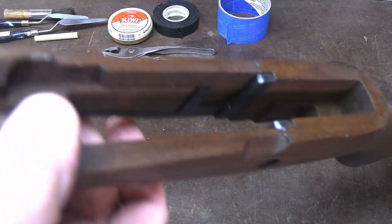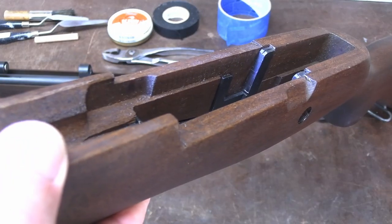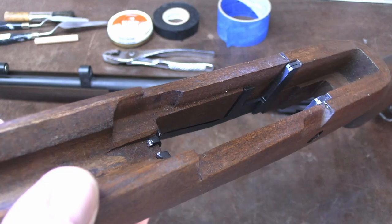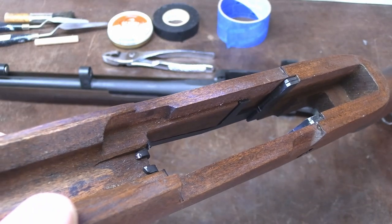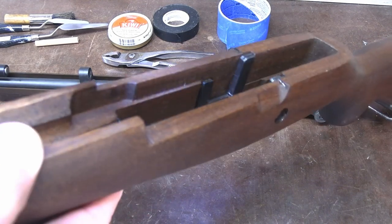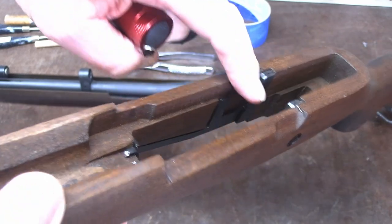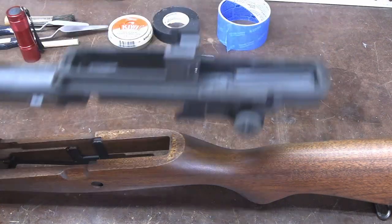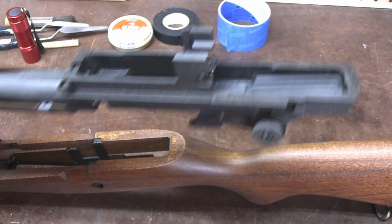And if you can see that, get it toward the light, shine a light on it, you'll see that it's got impressions where that steel has married with the receiver. This rifle has been fired perhaps maybe 300 or 400 rounds, that's all. But in that amount of time, the marrying of parts has already occurred. This stock reinforcement has compressed under the recoil of this recoil surface here, and they're fully mated. There's absolutely no reason why we need to alter that relationship.